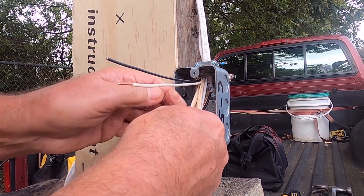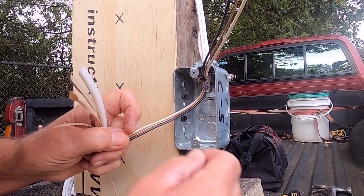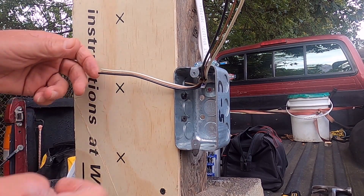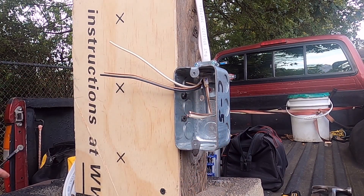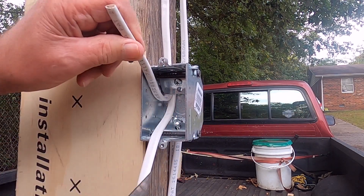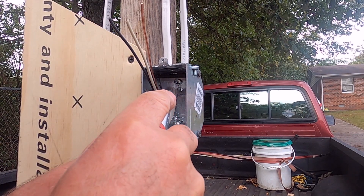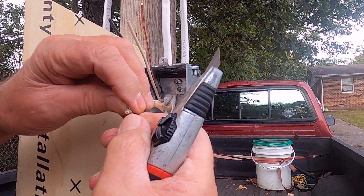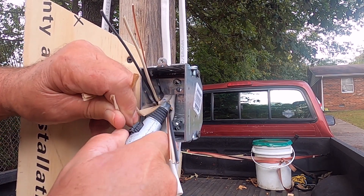What we're going to do is come in here first and get these stripped out of the way. I've got my wires marked at the top of my insulation — I know that's my light switch right there, and then that's going to be my outlet right here. By code, you're supposed to leave at least six inches of wire sticking out of your box, so you can access your receptacle or your plug-in in case you need to get in here and work on it again.